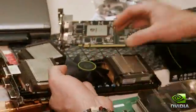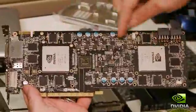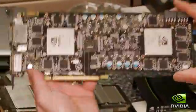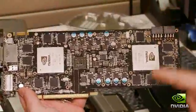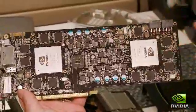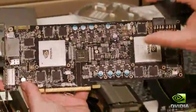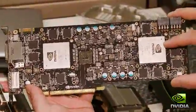If you take the vapor chambers off and dig in, what you'll see is a card like this. There are two GF110s, and the big switch in the middle is our own PCI Express switch, which allows these GPUs to get full PCI Express x16 bandwidth. You'll also see there are 10 regulators just for the GPU, and another four regulators for the memory. Those GPU regulators allow us to get really clean power so the GPUs can run really, really fast.